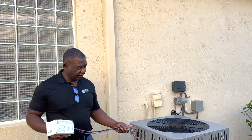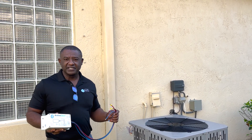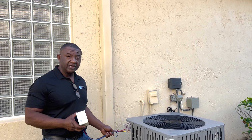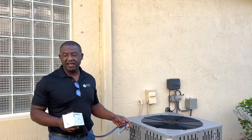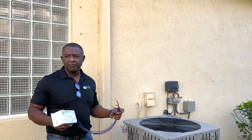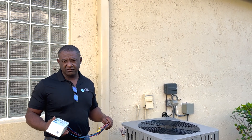We have a smaller one. I'm not going to show the whole installation but you will see this running. I'm going to do a pre-measurement like I did last time so you see what the unit's doing right now. It's a cooler day, so I don't expect the numbers to be really high, but you should still see the same reduction in inrush current that you've seen before.